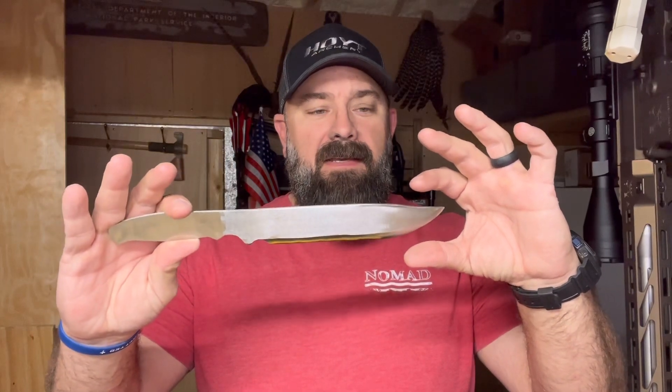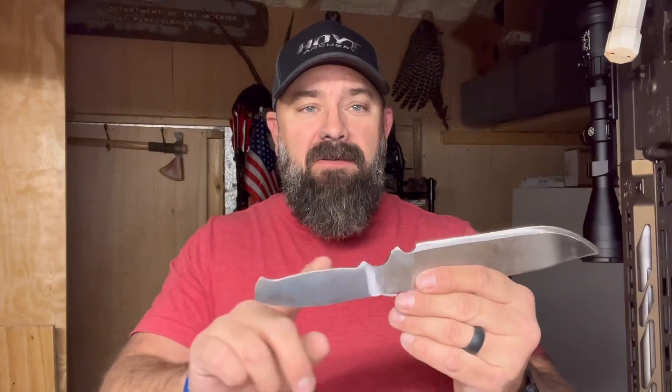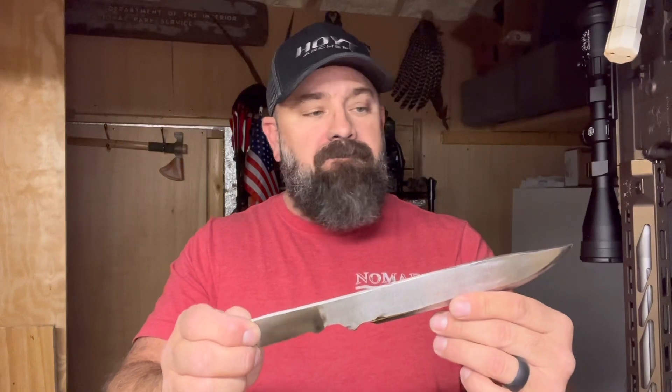This is just another option for you. If you don't have the space or aren't able to get into practicing basic blacksmithing, you can always get these little rectangles — about an inch and a half by 12 inch rolled carbon steel plates. Draw the design out and cut it with an angle grinder or cutting grinder, then use a file or a belt sander with different grits of sandpaper to finish it off, smooth it out, and make it look a little shiny.